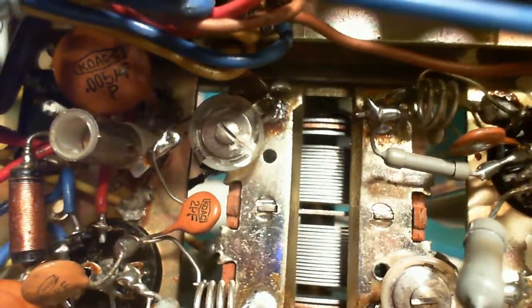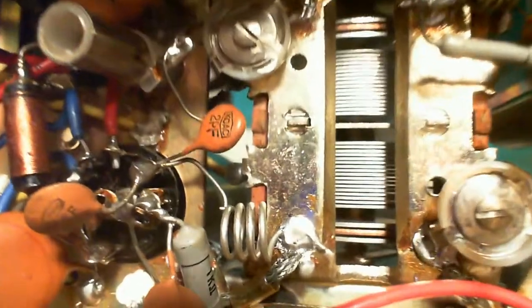A couple of you have recommended that I just go through and re-solder all the connections, and I'm counter-inclined to do that because of the chance of introducing a problem. Or two or three, if you went through and re-soldered all this stuff and you really introduced a couple of problems, good luck finding those after. Especially after you re-solder it and it didn't work, you might not be suspicious that the soldering was the cause.